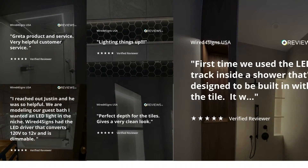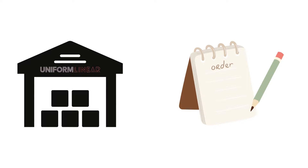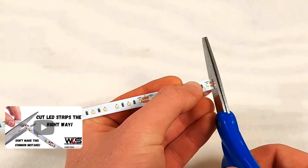Let's get started by cutting it to the desired length. You can watch our video to learn best practices when cutting LED profiles. Don't forget to cut the diffuser as well — we can cut both at the warehouse, just let us know in the order notes. Now lay your strip in the profile and select the most suitable point to cut. You can make the actual cut with an ordinary pair of scissors.